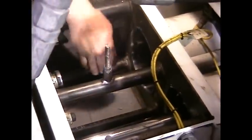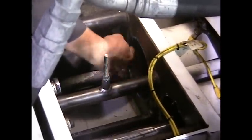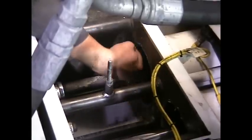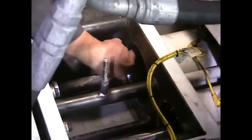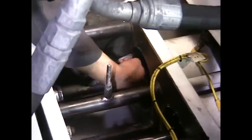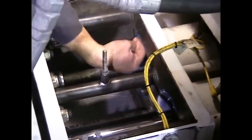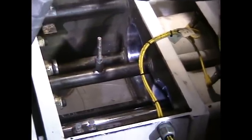We also need to clean the flush box, which I've already done. You always want to feel inside your chrome cylinder. It's somewhat abrasive, and if you just install a new piston right now, you will shorten its life because it's going to be rubbing back and forth over this abrasive surface. So I'm going to get my scraper and just scrape that stuff out. Now we've got the cylinder nice and clean — I don't feel any buildup or caked-up sediment of any type. Nice and smooth. Now we can grease the cylinder.